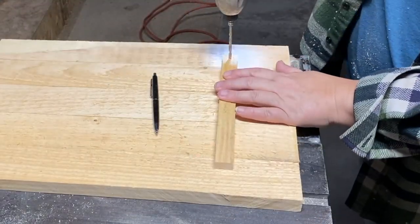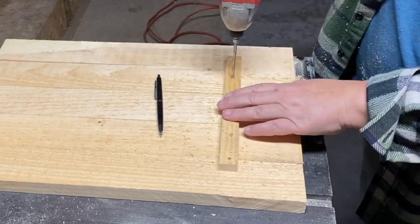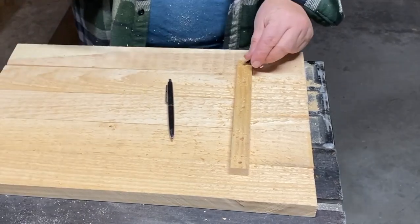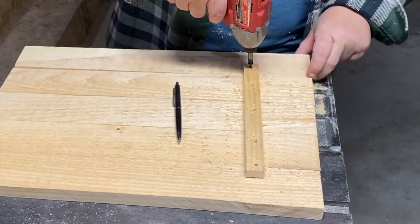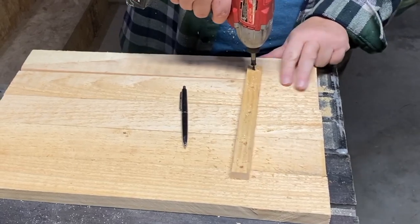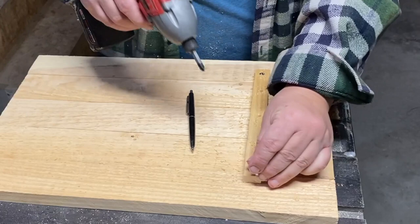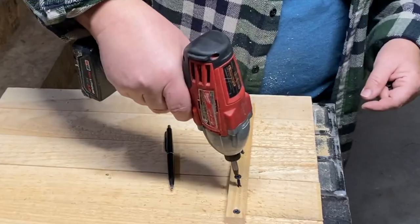Once I got it cut down to the size I wanted for the top, I took a couple of strips of wood and put those on the back, and put a few pilot holes in them so it wouldn't crack since they're so thin. Then I'm just going to take some wood screws and screw each individual plank for the top down. I have to be mindful of my edges so they don't hit on the outside of the stand — they're a little bit shorter and go around the inside so they'll fit.